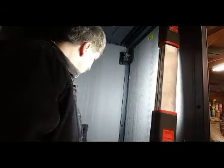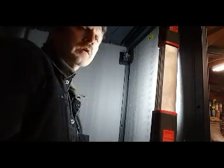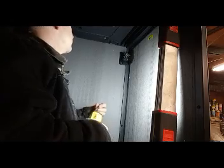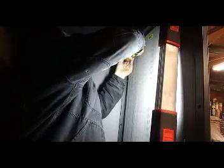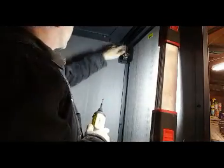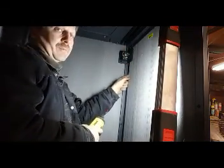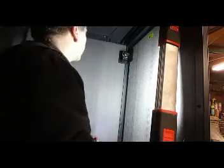All right. So once you got it in there, there's not much other lining up to do. I'll do the outside hinge screws. You can see at first it'll pull away. You can't see in the camera there's a gap here. But when I pull these screws in, it's going to close up. But you can see I can't really get in there very well, and I'm not gonna. I'm going to put all the outside screws in and then open the hinge and do it.